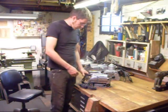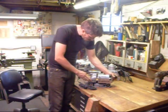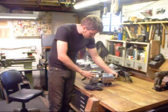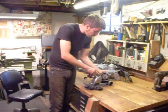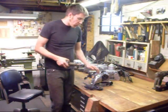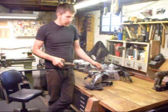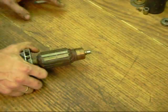This A3 here has been partly disassembled. With the screws out, if I pull on that front casting — which on the A3 is much longer than on the 504 — I can turn the unit and pull the armature out. When buying any used power tool, one easy test you can make of its viability is to rotate the armature in the machine by hand.